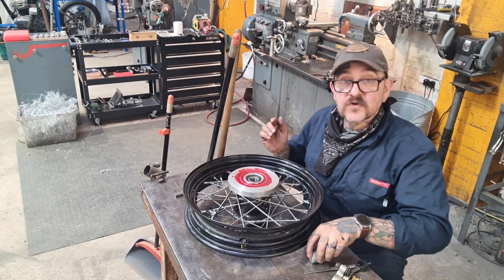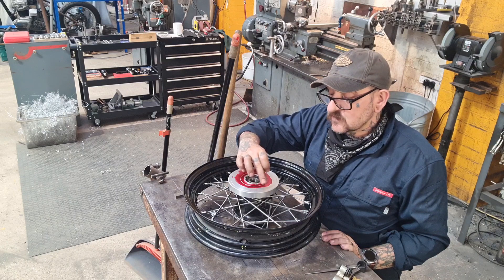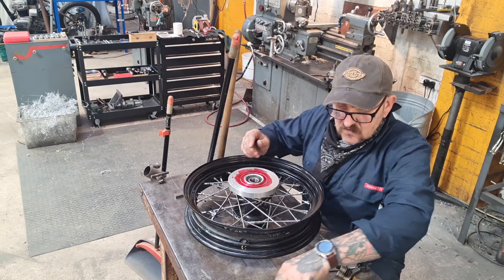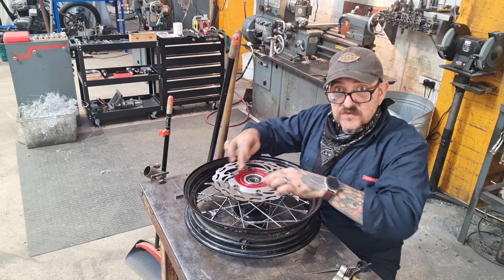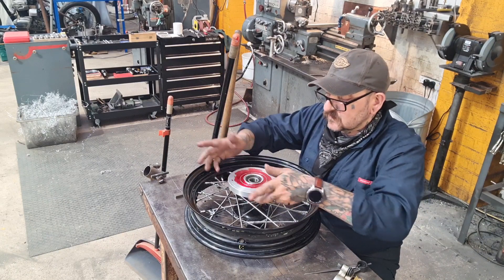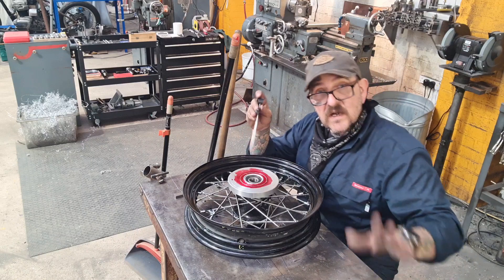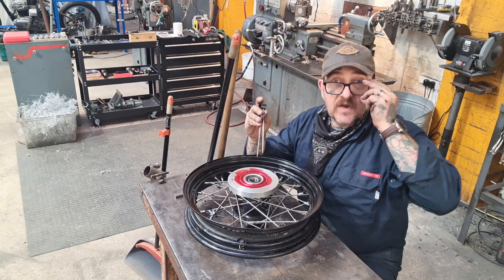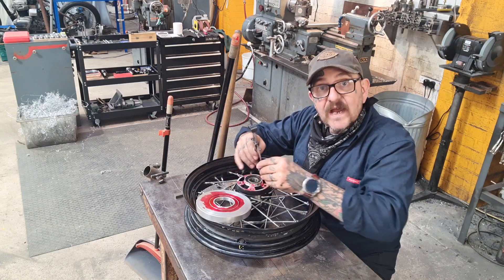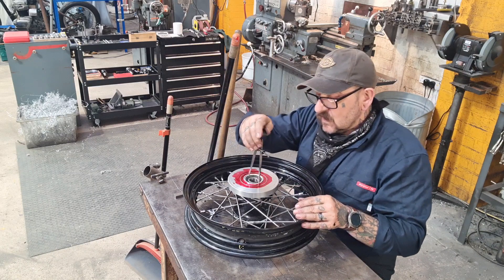I've got this machined, everything's on order. What I've done is used the lathe to give myself a line to work to for the holes — the bolt holes to bolt it to the wheel, and for the disc holes. I've simply measured across to get the diameter of the holes, then came out from the centre and in from the outside. The difficult bit is dividing that circumference into five. There is a mathematical formula, but I like the Nick Collier method — all you do is guesstimate the centre, get about right with calipers, give yourself a mark for a start, and then plot it round.